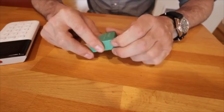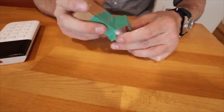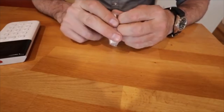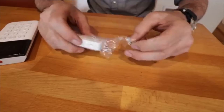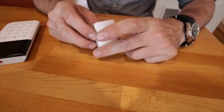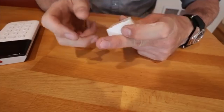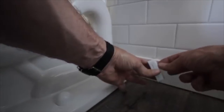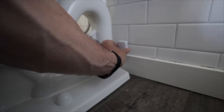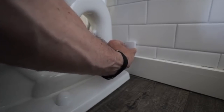This little freeze sensor was kind of an unexpected surprise. For me personally, the bathroom off my office is not very well insulated, and I worry about it sometimes. We've had the pipes freeze in there before. What we typically do is just let the water drip a little bit when it gets really cold. I'm going to put this out there and it will give me a little heads up that I need to make sure the water is running. I'm going to put the freeze sensor on this external wall — down low makes sense because heat rises. I've had this supply line freeze here. I like these freeze sensors — I'm going to get one where I store my paint too, because if your paint freezes you'll ruin it. And I'll put one in my van as well.